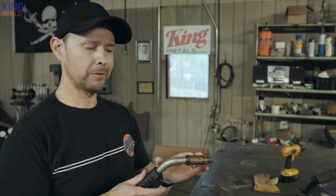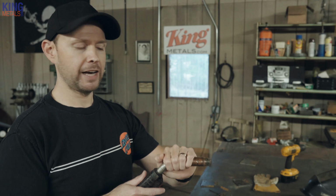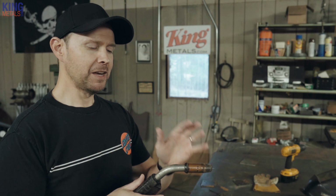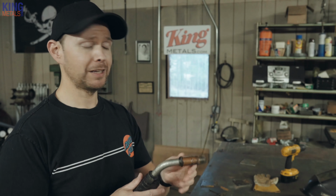Now the feedback on those has been great, but it's also brought in quite a lot of questions, and a lot of them seem to be around the same thing: when people are changing their liner or their nozzle and they're having issues with sparks and weird shortages and lights flickering. So I thought today I'd go over a simple way to tell if your gun is set up properly. So let's get into it.